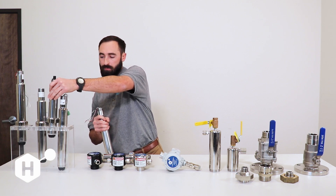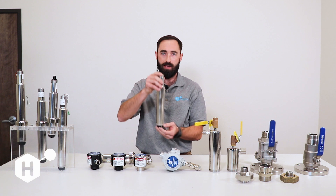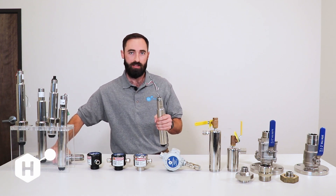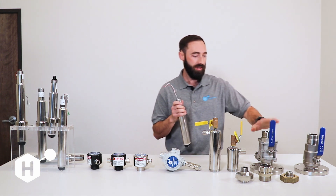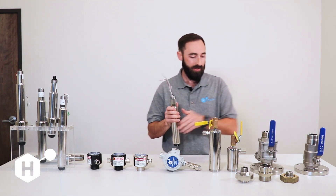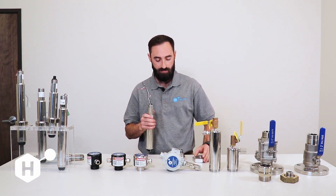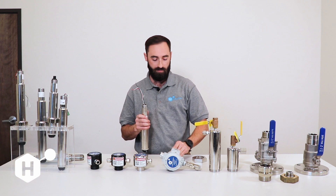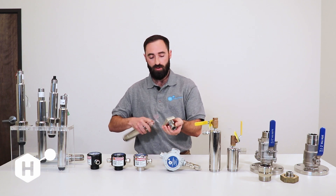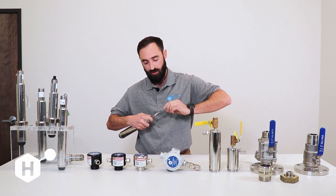The first type is our no flange sensor, also known as a hot tap sensor. This sensor is built for installation directly into a ballast water pipe using a two-inch ball valve. The common configuration for this sensor will be a valve adapter and a valve union nut installed onto the one-inch NPT connection on the top of the sensor.